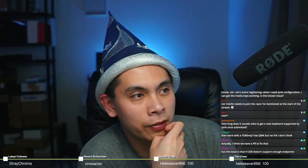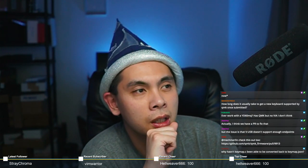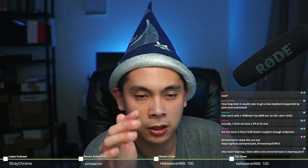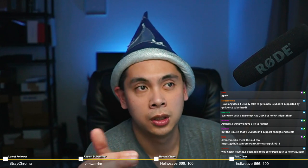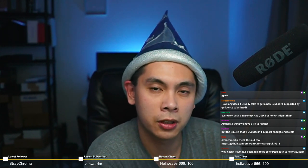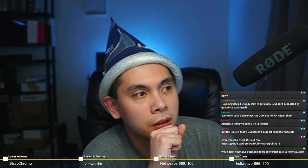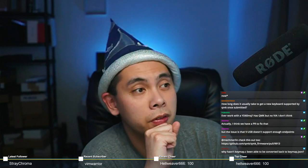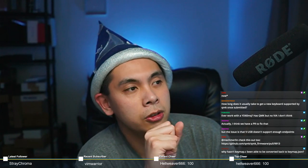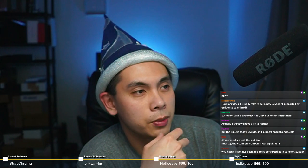Dub Sedan says, ever work with a YD60MQ? Has QMK but no VIA? No, I have not, but if you rewatch this entire stream, especially the VIA portion, or if you watch my last 5 other Tuesday streams, you can see how I've done VIA in each portion of that. And you can do it yourself. Droshna says, I think we have a PR to fix that, but the issue is that VUSB doesn't support enough endpoints. Droshna wants me to check out a PR.